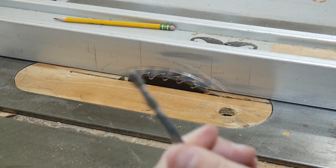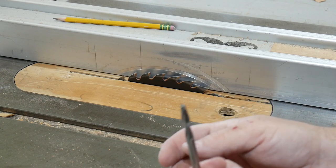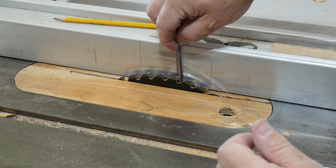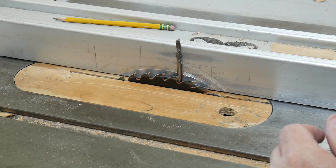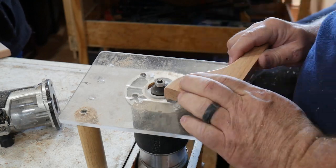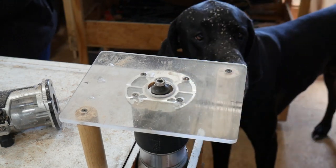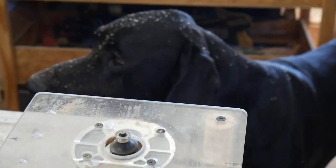Here's a trick I use quite a bit: grab the router bit — we know what size the mortise is because we used this quarter-inch router bit. Use it to determine the thickness of the floating tenon. It now becomes the perfect feeler gauge to set your fence — tap left and right until it's the correct distance, then lock it down. Here I'm rounding over the corners on the edges of the braces, and we're bedazzling Atlas's head with some accoutrements. Safety inspector is coming!